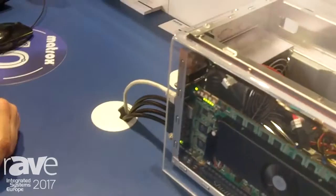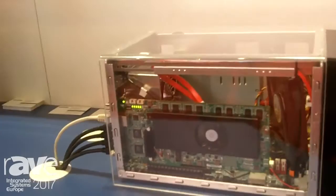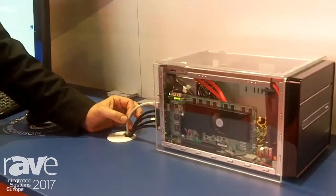This is a subset here. It is a card that has four DisplayPort outputs, so it can operate up to four 4K 30Hz displays with this card. What sets it entirely apart is that all inputs it receives are coming through IP. So it is an IP decoding card, receiving IP sources that are either encoded by Matrox encoders somewhere else, but it could also be surveillance cameras, which in most cases are IP cameras anyway.